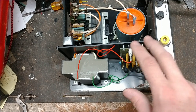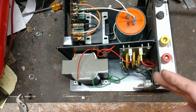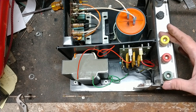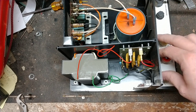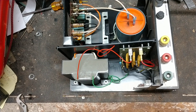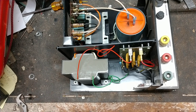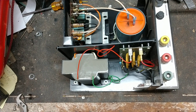Cyclops still uses one today. Zareba and Blitzer — like their 100-mile, 200-mile, 120 and 240-mile units — have the Storm Guard that screws down to the output terminals, which is basically what this board is. If you test a Zareba 100-mile-plus unit without the Storm Guard, you get about 8,000 to 9,000 volts. Put it across your fence and ground terminals with the Storm Guard on and retest, and you get about 6,000 to 7,000 volts. It drags down the voltage slightly, but the joule output is about the same because it doesn't really affect the other stuff too much.